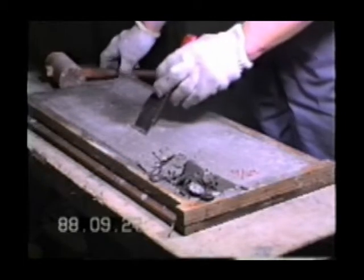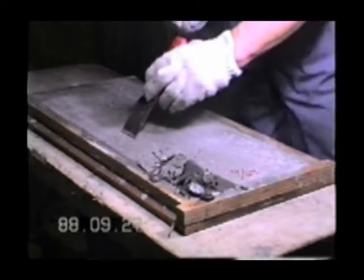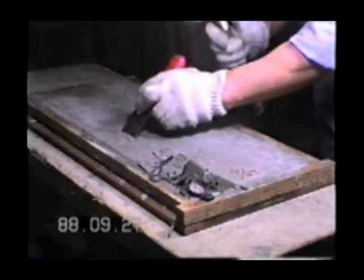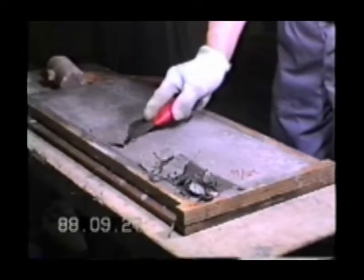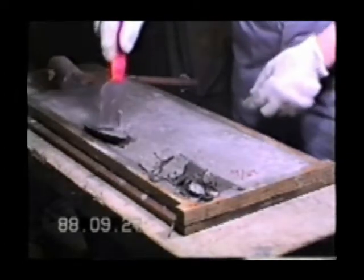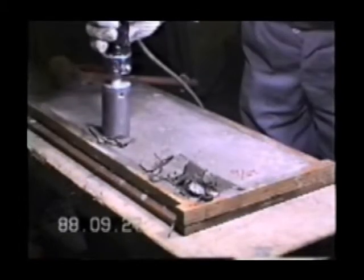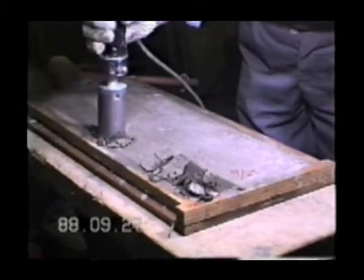First of all, let me show how the ultrasonic compaction phenomenon works. A cylindrical ultrasonic resonator makes lumps of low water content mortar liquid. In consequence of liquefaction, the lump of mortar becomes one body with the mortar in its vicinity. The specifications of the ultrasonic resonator are a vibration frequency of 28 kilohertz and a vibration amplitude of 5 micrometers.